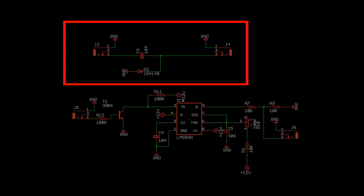Let's look at the circuit for the gate to trigger. It's fairly simple: a capacitor to block the DC of the gate, and a diode to prevent the output from going negative when the gate input is released.